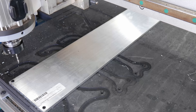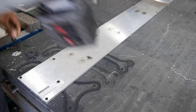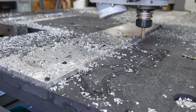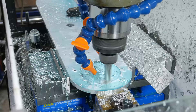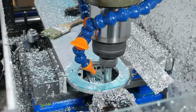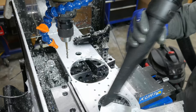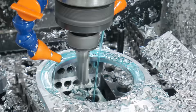This section of the arm is much longer than the full travel I have on my Bridgeport, so I decided to bring it over to my wood router — but the wood router is not rigid enough to cut all of the precise fits I needed. The compromise was to cut out the profile there and put in some locating holes, then do the precision work in two operations on the Bridgeport. Over at the Bridgeport, I could set my origin at the locating hole and let some of the metal hang off the end of the table. Once I finished the first set of operations, I could shift everything over, set my origin at the locating hole again, and run the second operation hanging off the other side.